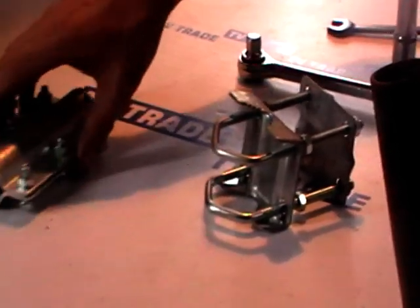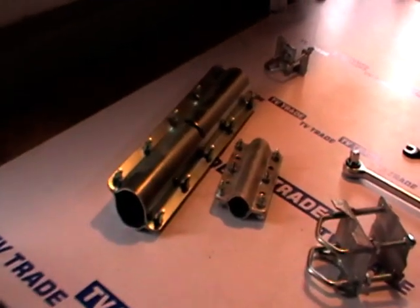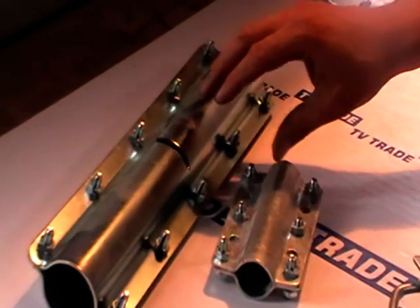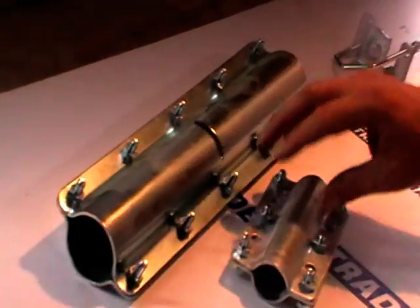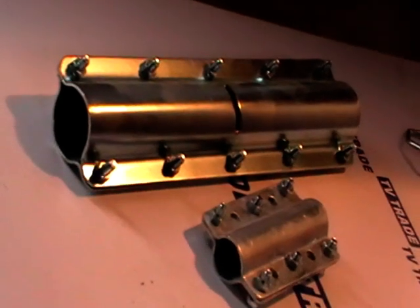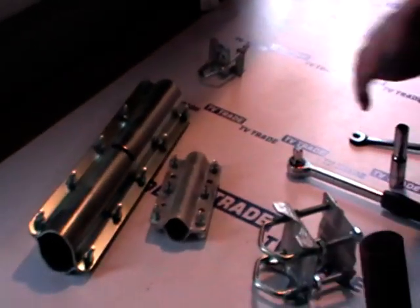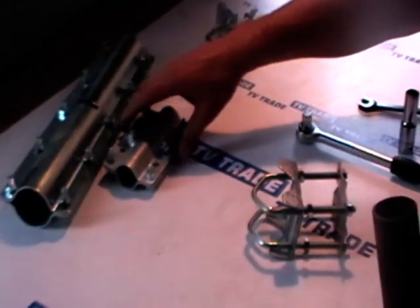The alternatives you can possibly use instead of this particular bracket are in front of me here — pole clamps. We have an inch and a quarter and two inch pole clamps. The reason these are sometimes preferable is that they give a very strong join because of the much larger surface contact area. But the big disadvantage is that the poles have to be a very specific size, and both poles have to be the same size. You can get intermediate pole clamps or pole couplers in different sizes, but you'll quickly find you need an enormous array of them. This is a single pole bracket that suffices for almost all situations.